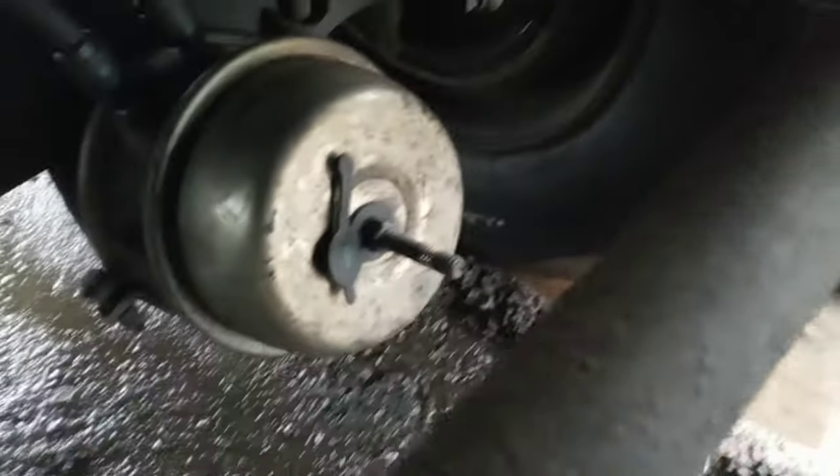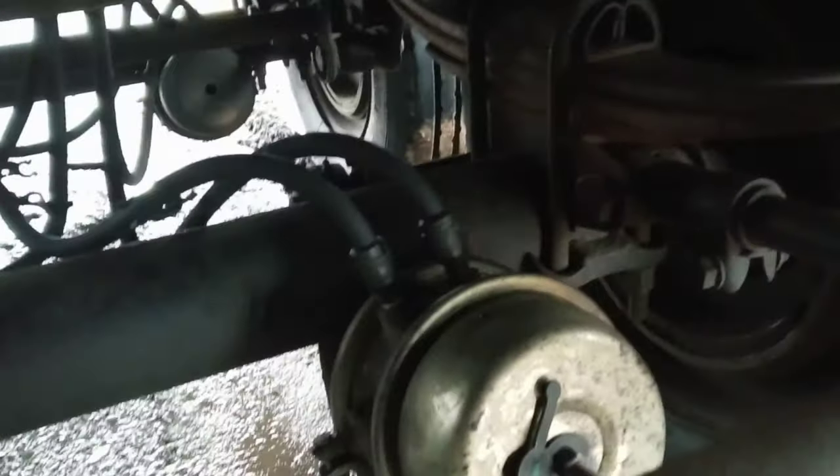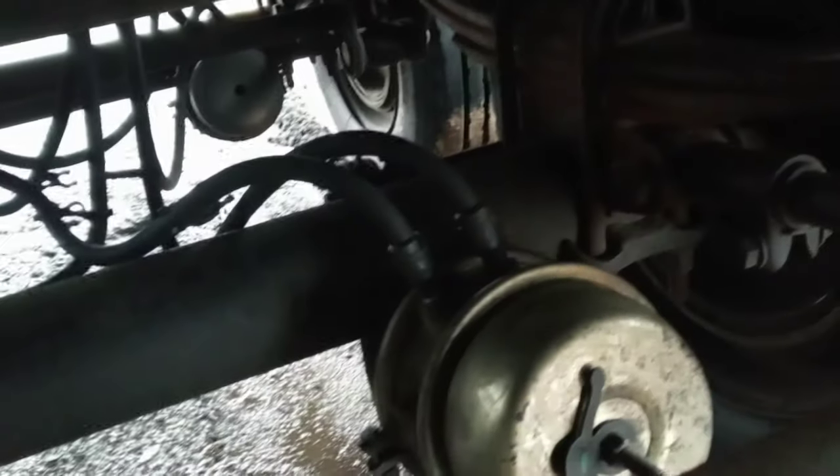The other thing we're going to have to deal with is that there is not a caging bolt on all of these brakes — somebody might have stolen them, or they may have been used before. So we are going to take one each off of our two trucks, and then we'll have two extras for this job to release all four brakes on the trailer.